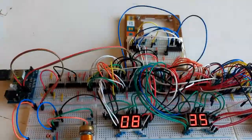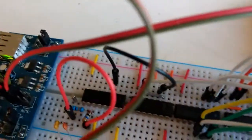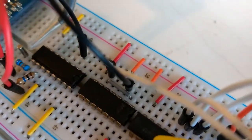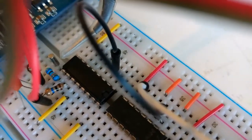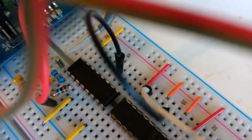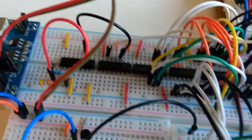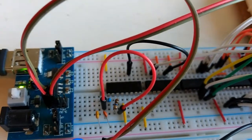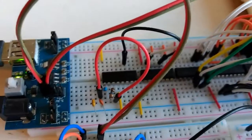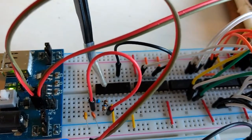The circuit starts on the far left where there is the quartz crystal — a Citizen watch crystal with a 32,768 Hz resonance frequency. That is hooked up to a 744060, which is a combined timing circuit with a 14-stage ripple counter. It gets the crystal to oscillate and then divides the frequency of the pulse down 14 times, giving us precisely 2 Hz.